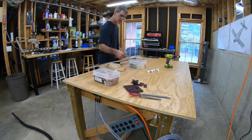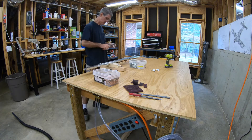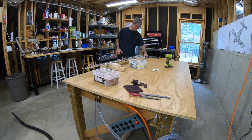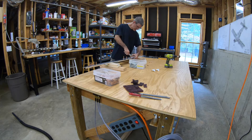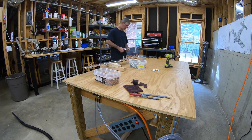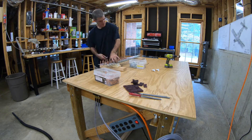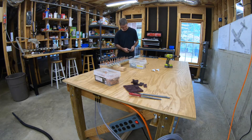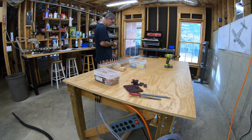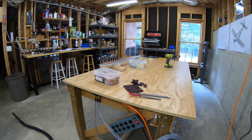I debated which way to orient the spar doubler — it had kind of a pretty good bow in it, just like the spar caps did. I was trying to decide whether to make the bow of the spar caps and the bow of the doubler cancel each other out. In the end I did it the other way because I felt it was better not to have the bow of the doubler pressing the tips of the doubler ends into the spar. It seemed better to have smooth uniform pressure along there — to avoid a stress riser right at those points. Now that it's all clecoed together it doesn't really seem to have any real bow in it; everything gets straightened out by the spar.